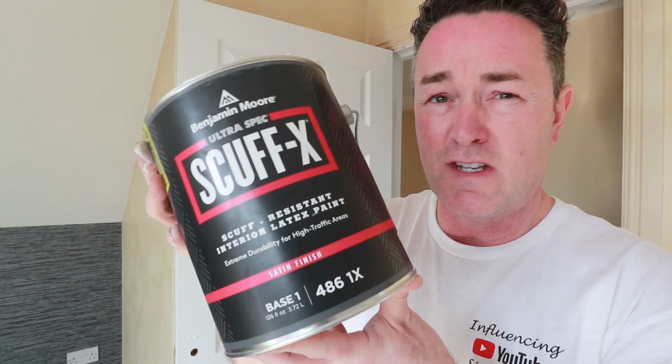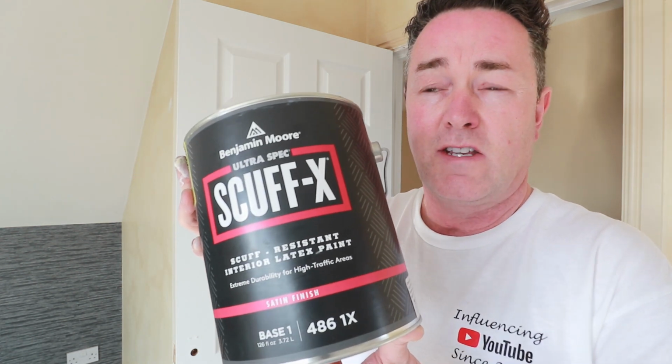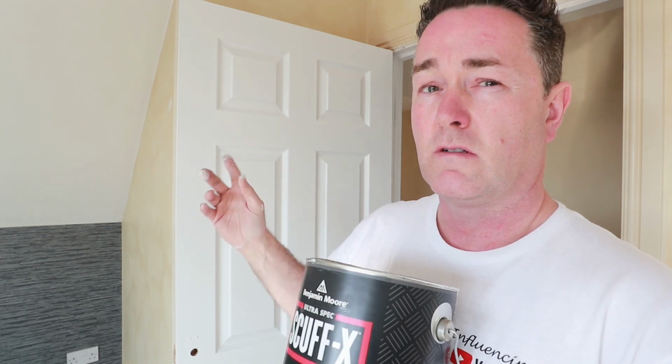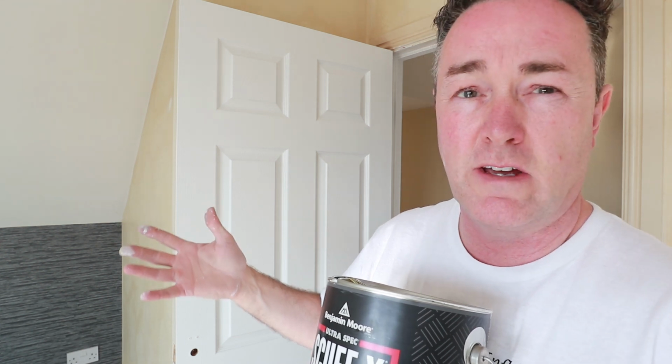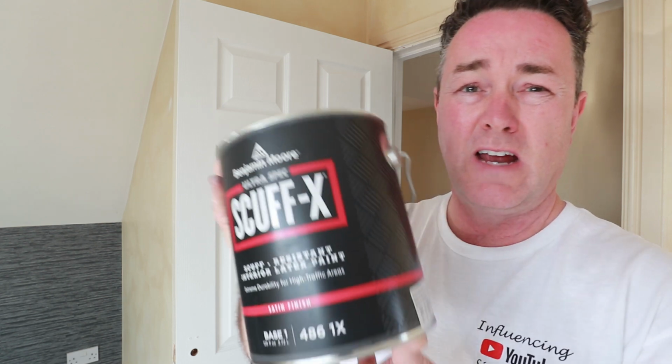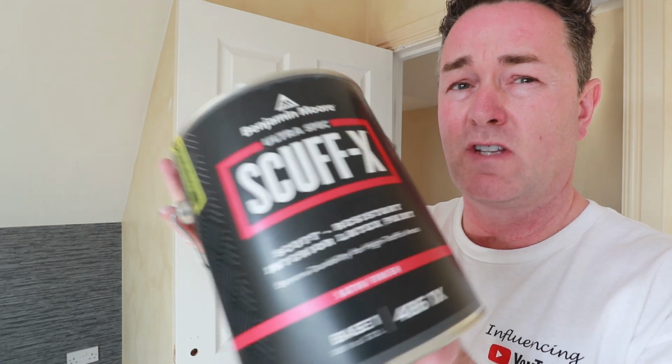But this paint, I have to say, I'm impressed with it and I do like it. It's only taken 2 coats. I know I was going over a 1, 2, 3 and it was magnolia stroke gardenia, but I think if you were going over previously painted white woodwork, you'd have no problem with that, and it'd go for 2 because it'd grip as well. The coverage is nice, and when I say coverage, I mean opacity. So give that a go, see what you think.